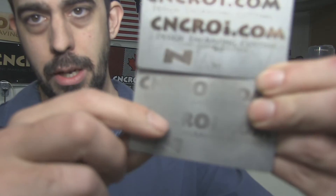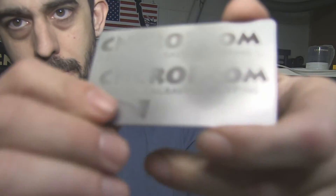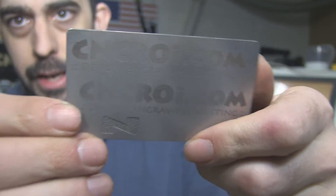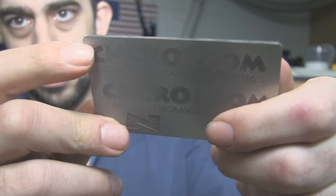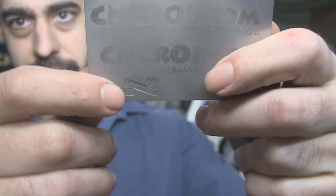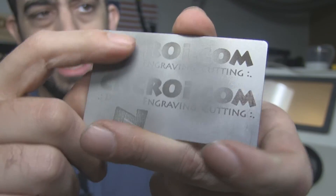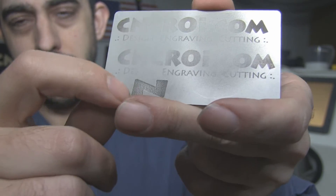What I did with the sandblaster is I showed the videos of us sandblasting the tags in real time. So if you see it takes 5 seconds or 10 seconds, it actually takes 5 or 10 seconds. Here are the results: the original tag is up at the top and the sandblasted one is below. The annealing is pretty much off but it's still visible. The etching up here — you see a bit of a shadow, so it is visible. And the very deep one here is clearly visible. I think this was around 5 to 10 seconds each. This one here was done double the time, just to see — and it's still clearly visible. We'll now do the same thing with anodized aluminum.